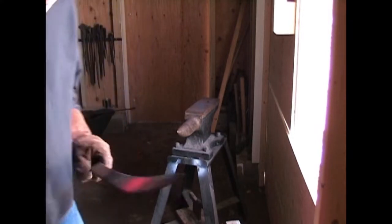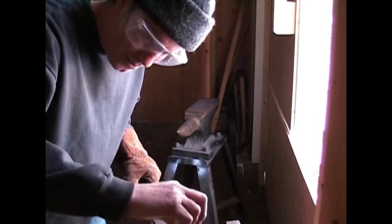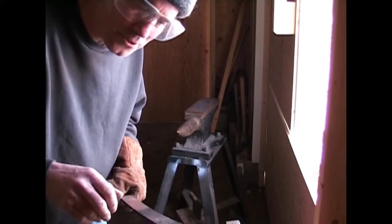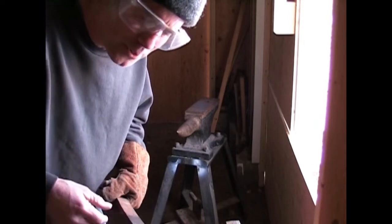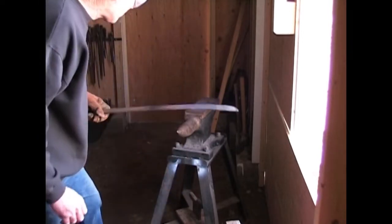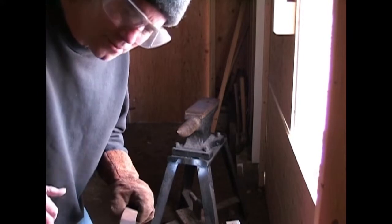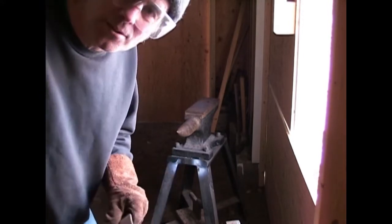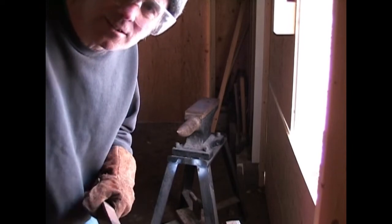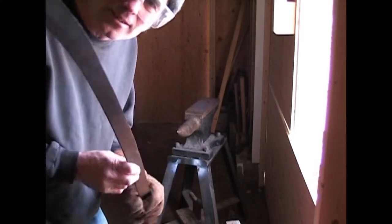I'm working on this pirate cutlass, pounding the edges down in a wedge shape — wider at the back, a little flat area, and then sloping down to the edge. When you're pounding metal it expands from the point of impact in all directions. You can kind of direct it the way you want to go a little bit. As it expands and I pound this edge, it's putting a curve in it. I might need to take some curve out. I'm thinning it down to a little less than a quarter inch — between 3/16ths and a quarter inch — and leaving it flat on the end about a 16th of an inch so the metal won't burn.